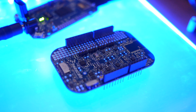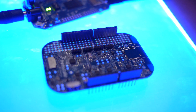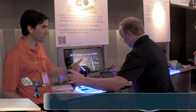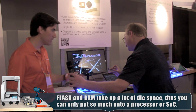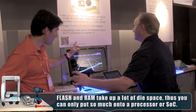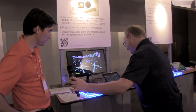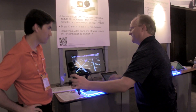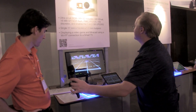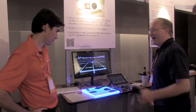It kind of reminds me of the BeagleBone Black — it's a Freescale version. It's got the Arduino headers plus expansion on the inside. There's not a smaller board that's as powerful with that many features out there — go look at the PCduino, the Udoo, the Edison; we beat all of them. Does this boot from the SD? No — we got the kernel into the flash. All the flash is on there, and the SD card just has the file system. That makes sense because then you're not re-writing the SD card with finite write cycles. This is the SCM i.MX6D.